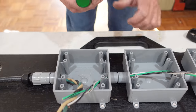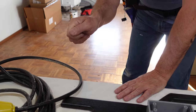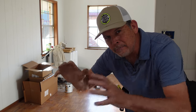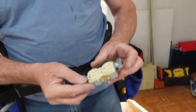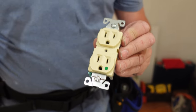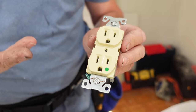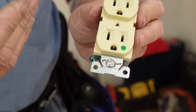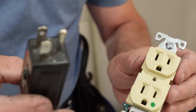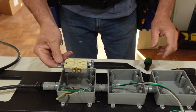What are we going to put in there? You asked for it — a green light indicating we have power. That way, when you've got your saw all lined up and you squeeze the trigger and get nothing, you can just look up at your ultimate power cord hanging on the wall, see the green light, and know you've got power. No more failed cuts on the crown molding. On the other side, we're going to put a hospital grade receptacle, indicated by the green dot. These are very heavy — much heavier than a standard receptacle. The strap and copper contacts are thicker and stronger, so they grip the blades on plugs very well and are much harder to pull out than a standard receptacle.